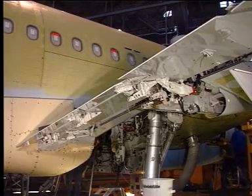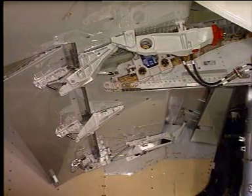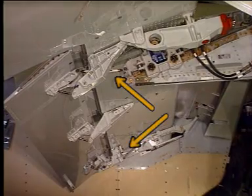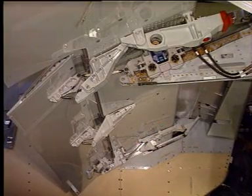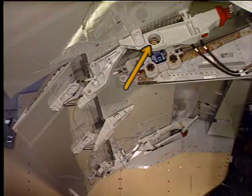The flap link arms move the flaps along the tracks on the carriages. Control rods connected between carriages 2, 3, 4 or Hinge 1A and the tabs extend the tabs at the same time. The flap link arms turn the flaps around the lateral pivot axis.